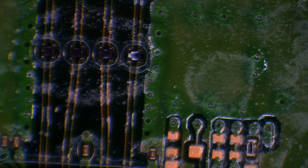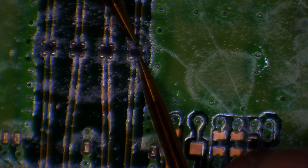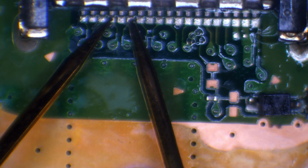The HDMI port can cause a blue light of death, mate, but it would have to be a short on, I think, the 5-volt rail against one of the data lines. Okay, yeah, so that does appear it was just what I did. That solder is very soft. I'm probably better off checking that against these here. If I check, for example, pin 1 and 3, and then pin 4 and 6, etc, etc.